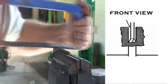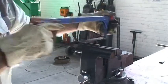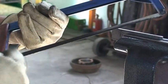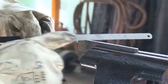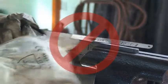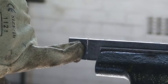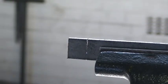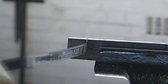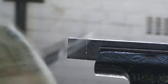The teeth are set to move freely in the cut. Should a blade break or become blunt before completing a cut and a replacement is necessary, it is not advisable to continue in the same cut with the new blade. As the blade goes blunt, the slot made by the blade becomes narrower. To continue the cut in the slot will usually cause the new blade to stick and become ruined in the first few strokes.